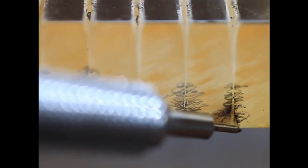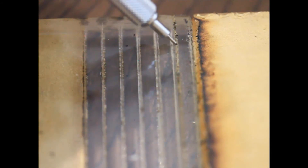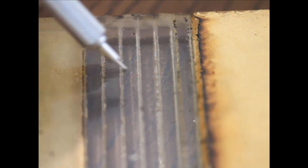I can definitely feel a ledge here, so it may have gone all the way through but not completely — I don't really know what to conclude on that one. The only way to tell is to look at the underside. For the 2mm per second that definitely went through — that's obvious. For 3mm per second I can feel a ledge, but I'm not actually sure there's a complete burn through. On the 4mm per second there's very little indentation, so it definitely did not go through, and obviously on the faster ones it didn't go through at all.